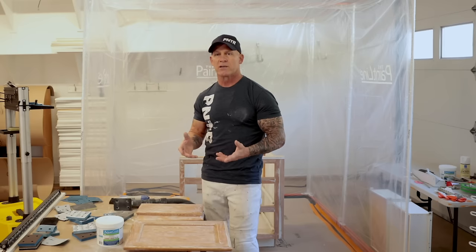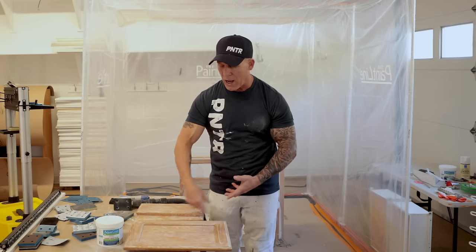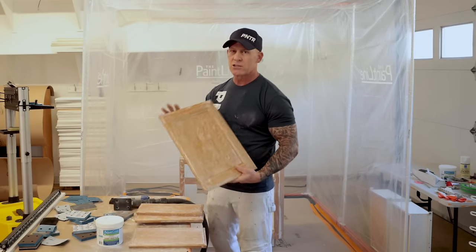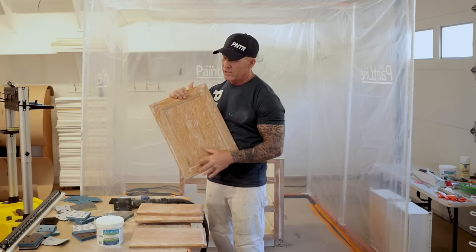So I have a method that I use when I'm caulking these things. I use a tile sponge, and it's a really tight open cell sponge, and I'll put a small bead of caulking around there, and the sponge is wet, and I'll caulk that thing, get a really tight bead, I'll smooth it out with the sponge, and then you'll have a really nice bead on the cabinet doors. Now, once again, there is a school of thought. Some guys are just adamantly never caulk these doors. I'm not going to be caulking these doors. I like the look of it without it caulked, but there are situations where